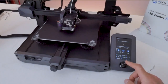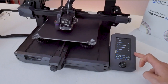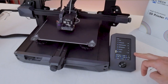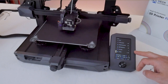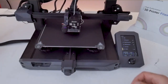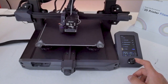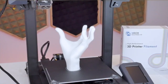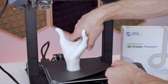As the printer is laying down its first layer, you're going to want to pay attention to how that first layer is going down — if you're experienced with 3D printing, you'll know what it looks like when it's too squished or the nozzle is too far away. The great thing is you can adjust the Z offset value on the fly. Click the tune button and within that menu head down to Z offset to make live adjustments. Bringing the Z value more negative squishes the first layer more; moving in the positive direction moves the nozzle away from the bed. My very first print on this machine turned out to be a success — it was a fairly large print and took upwards of seven hours to complete.